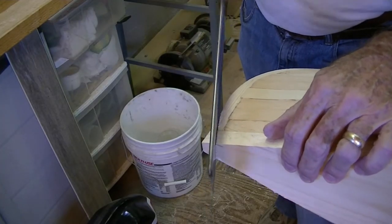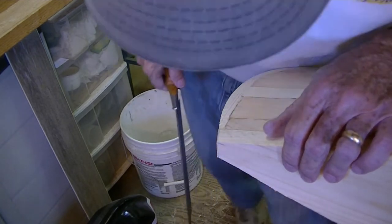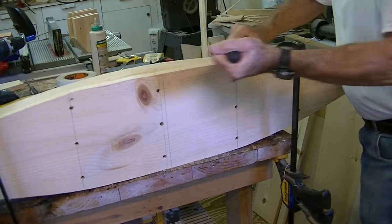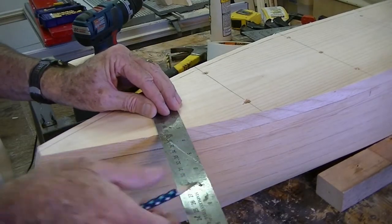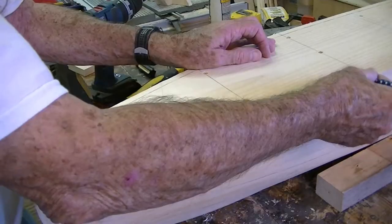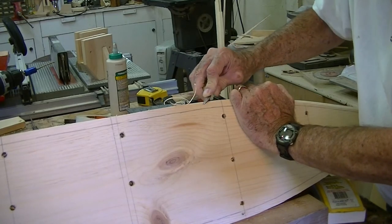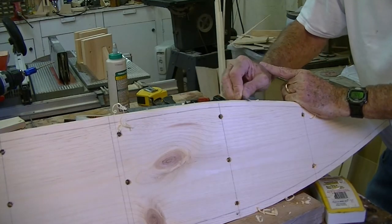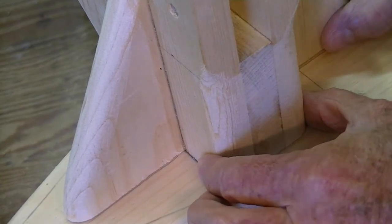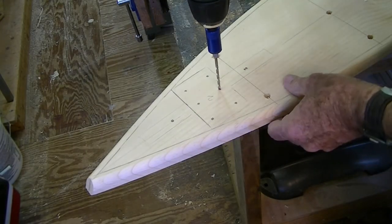I cut the end of the deck to make it line up with the stem. After I got the deck's edge flush with the edge of the hull, I marked a line a half inch from the edge all the way around the deck. I rounded the edge of the deck, staying inside the line I marked. Rounding the edge helps to keep air bubbles from forming under fiberglass cloth when bending it over an edge. I then squared up the post, traced its position on the deck, and marked and drilled holes to fasten it.